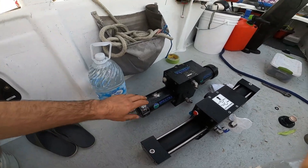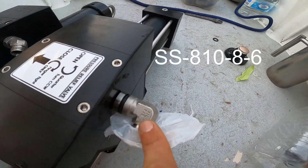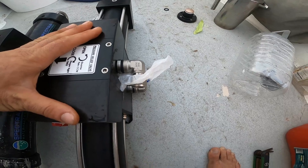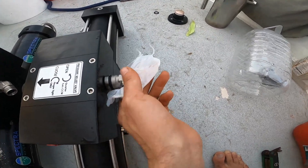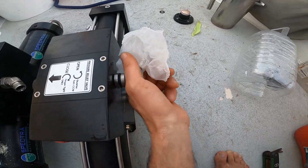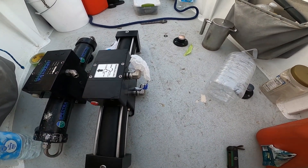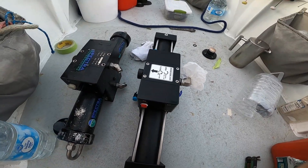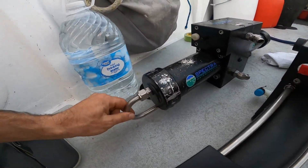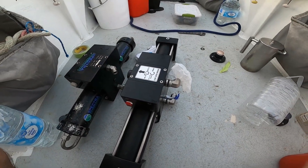As far as replacing your Spectra Clark pump with one of these, they have these swivel fittings. I put a Swagelok half-inch tube to three-eighths NPT thread — pretty easy to find tube fitting. These swivel fittings are nice because that hose that Spectra gives is pretty rigid. Everything looks very similar: same location for your feed-in water pump, brine comes out either side. Instead of using a J-tube, they're using a titanium rod. So we're going to hook it up and see how she runs.